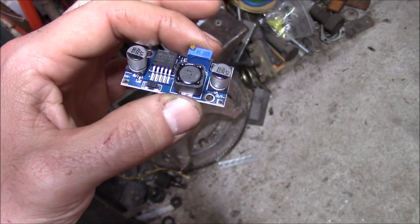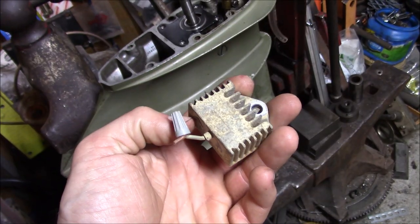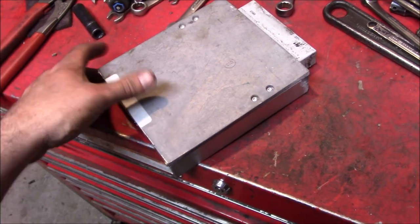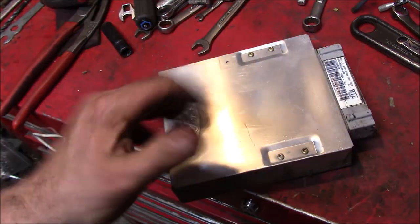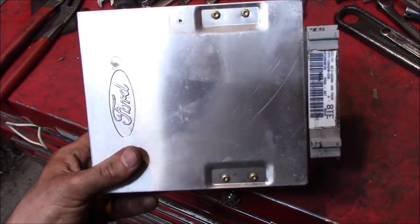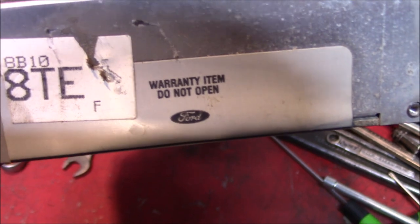As for the truck — you really don't need a computer on a 12-valve. We're converting it all to manual operation, maybe in a future episode. We'll need at least one voltage reducer for five or six volt outputs for the speedometer and tach signal, and the alternator will be controlled by a traditional voltage regulator that Chrysler used for a few decades. While we're on a roll with broken ECUs, this one is from the old '88 F-150 — just happened to have a spare already sitting in the truck.